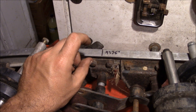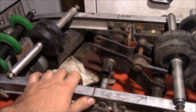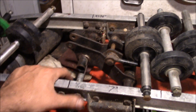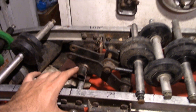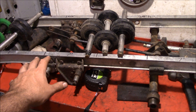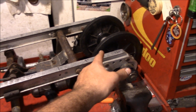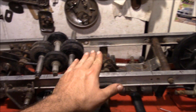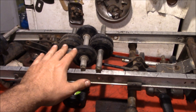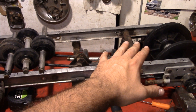Only 7/16ths compared to an inch and a quarter down at the back. We could try to find some larger idler wheels, but we're just using whatever we've got laying around and they're stock size. We don't need to do anything crazy. We know where this set of wheels is, and we know where those 8-inch idler wheels are. We just got to connect the dots now, the whole way down the line, and have a nice flat contact surface for where each of the other wheels are set up.